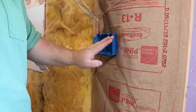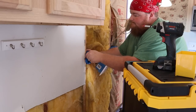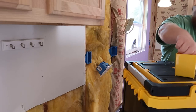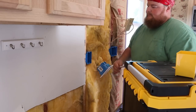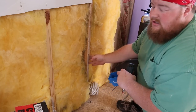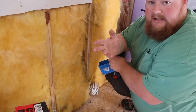It's kind of a weird box design how it comes out this way, but it makes sense because the drywall will pull it back. Looking good. Last but not least is this outlet down here for the dishwasher. A couple of you answered my question — thank you so much — about how to wire in a dishwasher, and the answer is: just put a GFCI outlet at least 18 inches above the finished floor height and plug it in. Thank you.